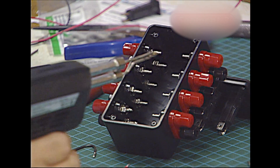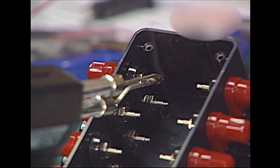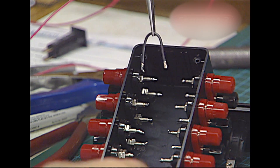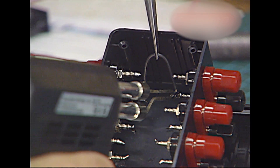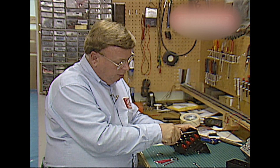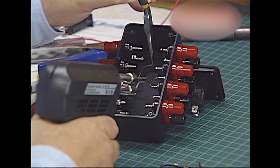You don't need to put any solder on the threads at all. Give yourself extra time to let the heat soak the post so the solder wraps evenly. The black ground wires are going to be a little bit difficult to do, so get them on a pair of long-nose pliers because they go all the way to the bottom and solder them to each side where the black binding posts are. Bend each wire down out of the way, and do the same with the other three black wires until you have all eight ground posts attached.